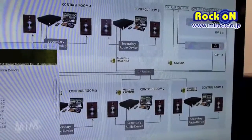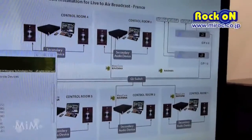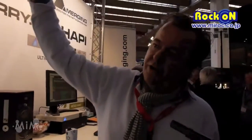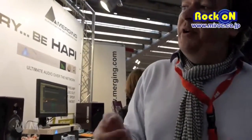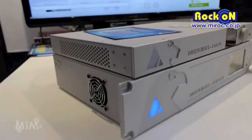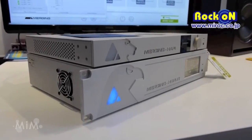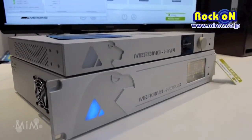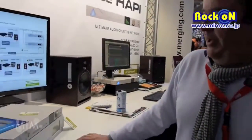And on the other hand, we could have, typically for recording, different HORUS or HAPI, for example, one on the ceiling close to the microphones and one on stage, going to a switch again, and then going to a Pyramix, for example, for recording, or any capable ASIO or Core Audio driver system on a Mac or on a PC to be able to ingest those audio streams. At the end, because it's Ethernet, very easy for redundancy and so very cost effective in this sense.